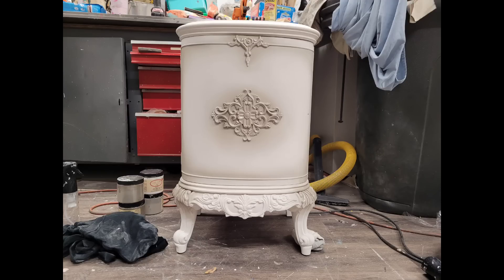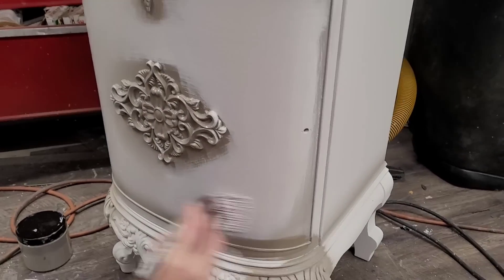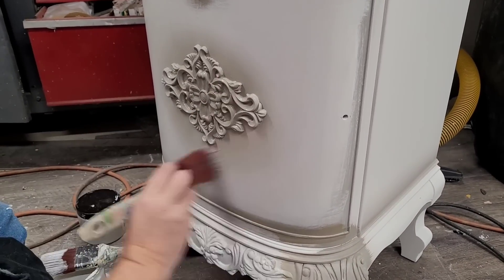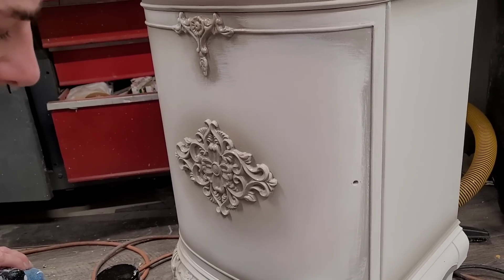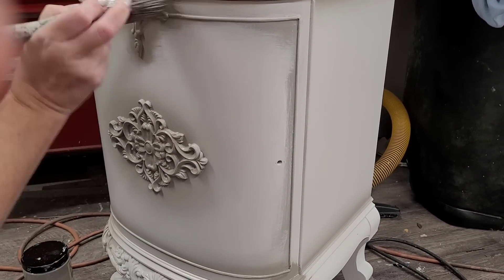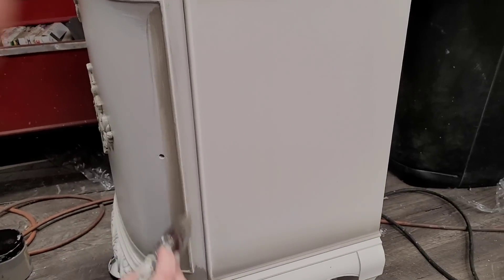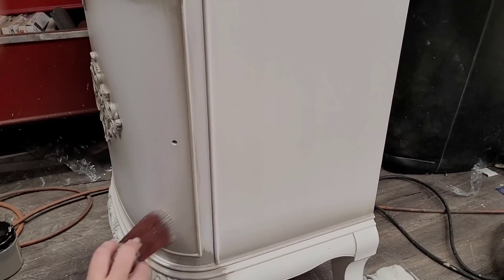Here is my nightstand with the base coat of paint on it — pretty, but not done yet. For my next coat I'm going to replace the French Linen and go over the top of it using Steel Magnolia, which is a Moonshine Metallic from Dixie Belle. You can definitely blend metallics into your flat paint — it works really well and gives a slight metallic glow to the moldings that then blends into the white Fluff around the edges. I'm using my Dixie Belle mini to lay on the paint and then my Dixie Belle oval medium to blend the two colors together. A two-color blend is a really nice place to start, especially if you struggle with blending — it's a pretty simple look to achieve.